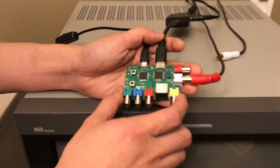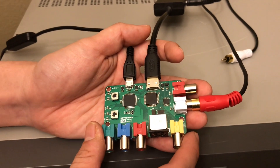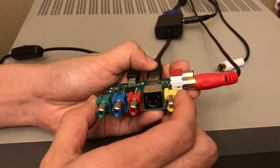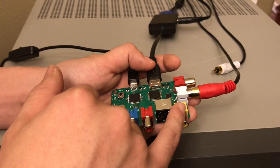So now it does audio capture over HDMI correctly, and it can do auto-switching between NTSC and PAL. And more than that, it can do both line-doubled and pass-through mode, where it doesn't do line-doubling, but it decodes either component, S-video, or composite into RGB.